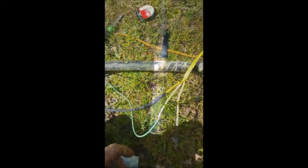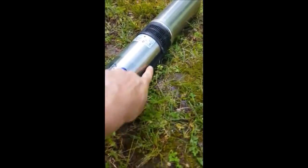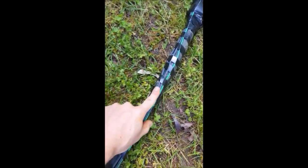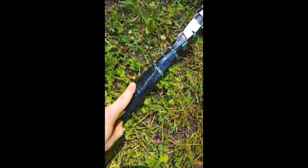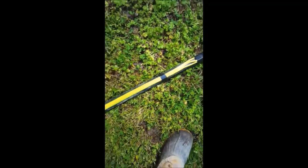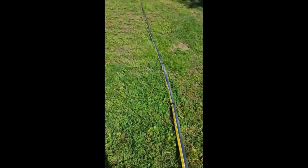Heat shrink is great, but the 3M tape is quick and easy and you get a whole roll. We're back with the pump, taped thoroughly. Starting at the pump — the wires come up through the wire guard and you want them as flat as possible. I've laid them flat, candy-caning all the way up with no twists or bulges, up to my splice, then continuing with the yellow wire flat. I tape every one foot to 18 inches right above the pump, then gradually go to every two to three feet.